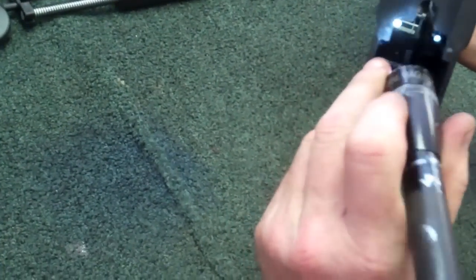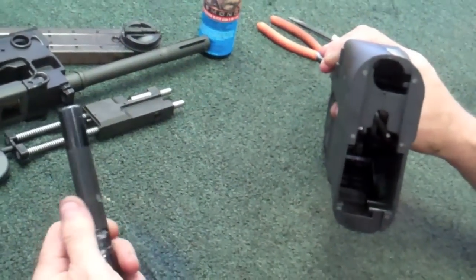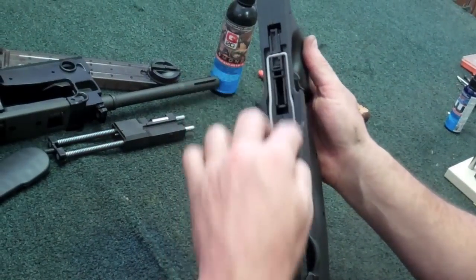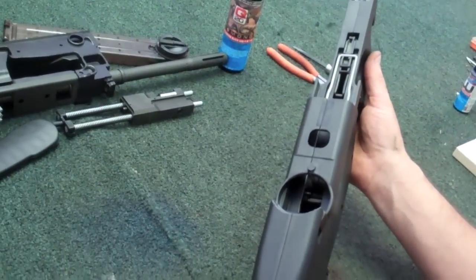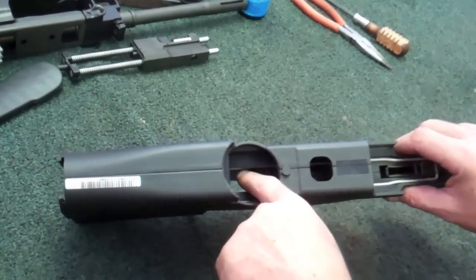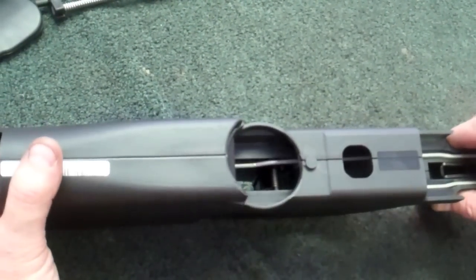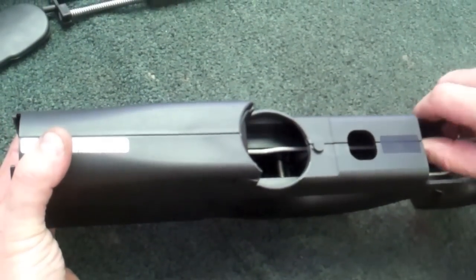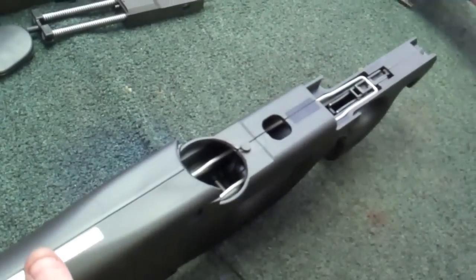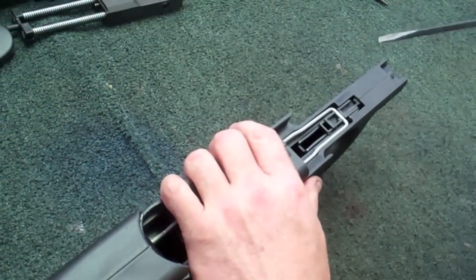If you look up inside right there, you see these two little metal rods. That's your trigger rod bar going from the trigger down both sides. That's what pushes back on your sear and disconnector. So what we're going to do — if you're looking through the top of the magazine opening right here — reach inside with your finger and find that first rod. Very carefully pull that up and out of the slot. Do the second one the same way, up and out of the slot. Now, since these are nylon plastic parts, you don't want to damage them, so be very careful doing this.